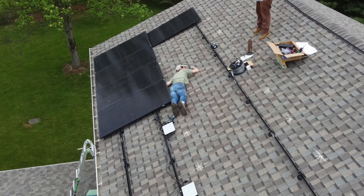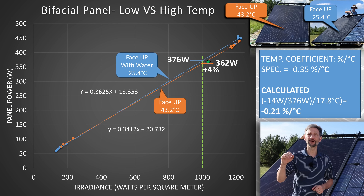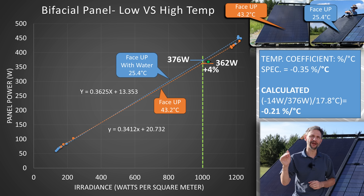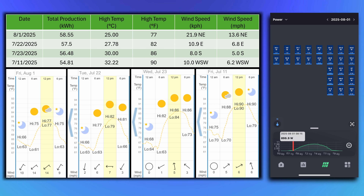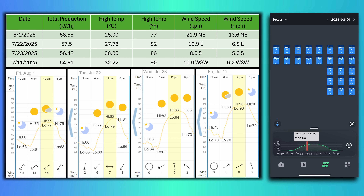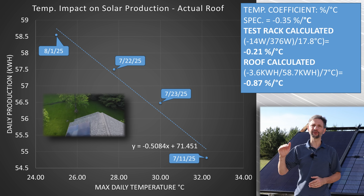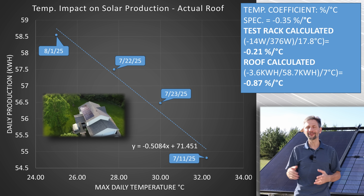The other big factor on a roof is cooling — it's hard to keep panels cool so close to the roof. I don't have a big temperature gap to work with, but my data shows a temperature coefficient of minus 0.21% per degree Celsius, slightly better than the rating of 0.35% per degree Celsius. So I was inspired to see if I can plot the temperature impact on a roof using some empirical data from Clint's roof. I looked at the total power production on Clint's roof on several sunny days, no more than 30 days apart near the summer solstice. I plotted them against the high temperature for the day to get this result. Of course, there are lots of other factors in this scenario such as temperature variation throughout the day, wind speed, slight variations in irradiance, length of day, etc.